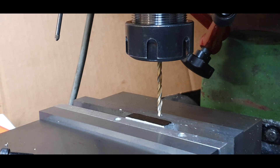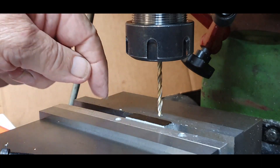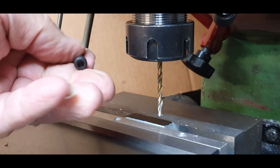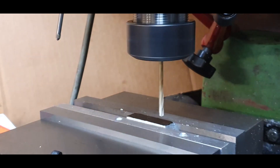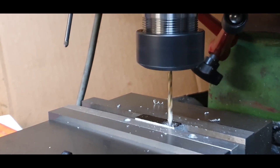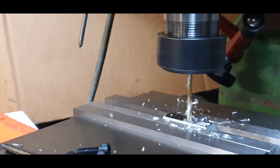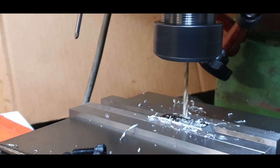Right, we're on our next stage. We've got a step on one side which goes over here then comes down, comes up the top there, and there's just a slight edge that will stabilize it. I'm using a couple of five mil by 0.8 thread cap screws. What happens is I'm going to drill the holes, tap them, and then I'll show you how it works from there. That's going right into the keyway that I actually ground out or cut out with the end mill.